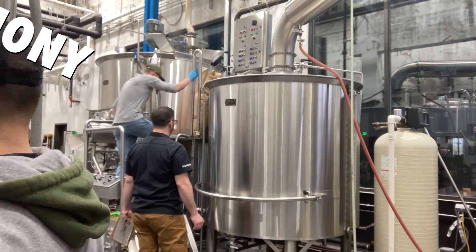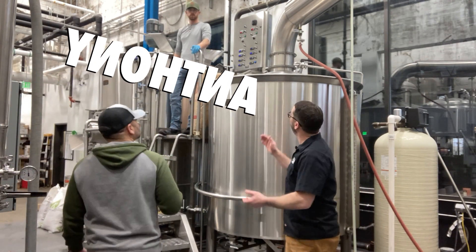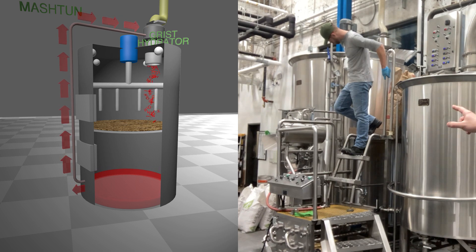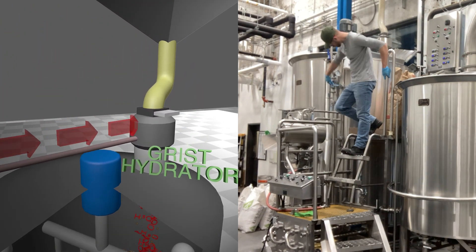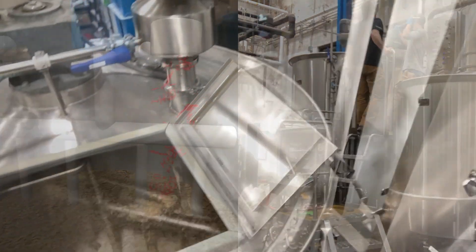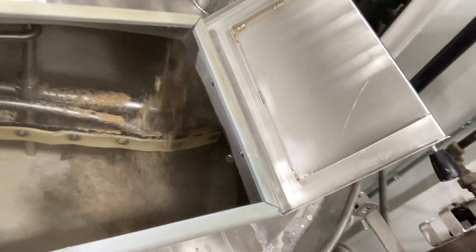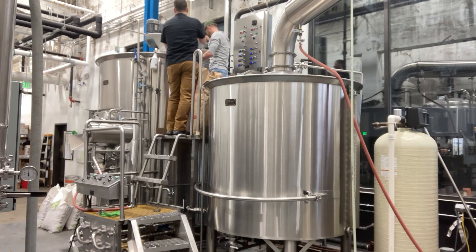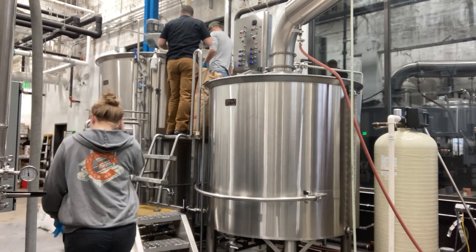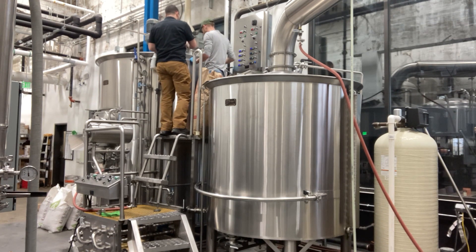Turn the rake on to 4, forward. Do we have our salt and acid up here? Right now we are pushing hot water up from the hot liquor tank, which is below the mash tun, up along into the grist hydrator. We've got our water moving, everything looks good, we've checked our clamps. Give that a little pop — it's more about sharp little nudges. Don't pull it all the way out; from there you can work it by hand, wiggle back and forth. Sometimes you need to give a little nudge. Right now you're going to let it catch up a little bit — I can see some dry grain falling along with it, and you can see it starting to pile.